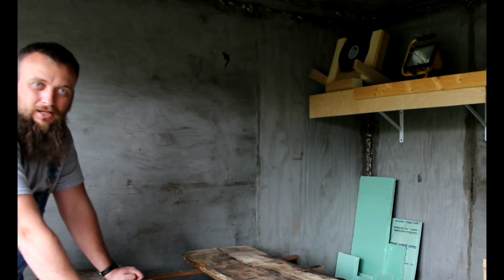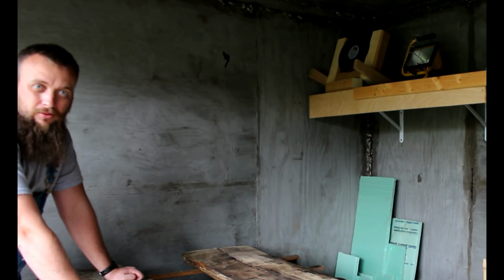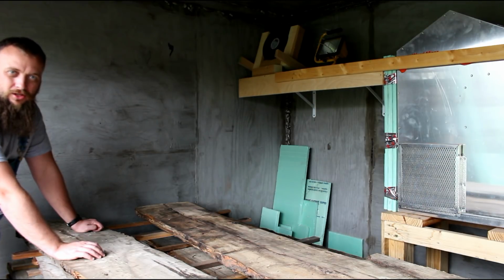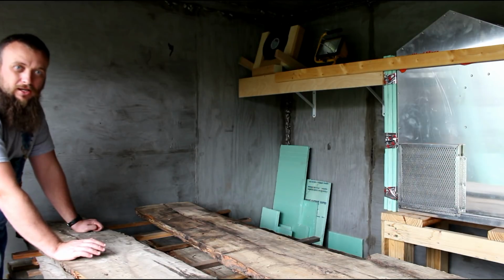Now if I had some pine that was air dried, I still wouldn't add it in here because of all the resin and the sap in pine and having to set the pitch when you're done. And these hardwoods here, they dry pretty easily. When you air dry them first, all the bad things have already happened, so you're good to go on that point. We will come back in about 8 days. It will take 7 days probably to dry this lumber, and then I'll do 24 hours to sterilize it at 150 degrees, and then we should have some good slabs and some good dry lumber.